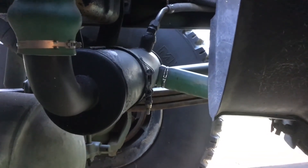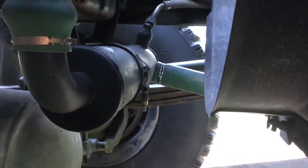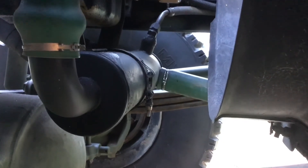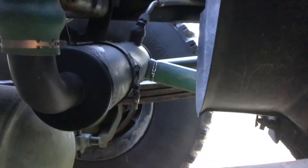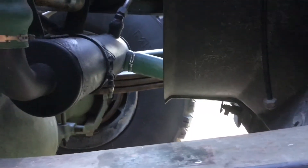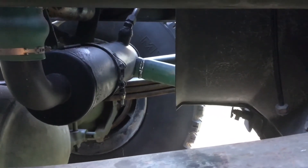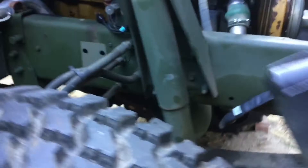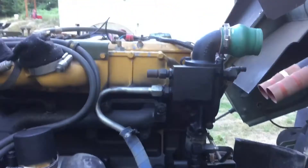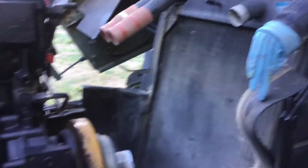So I can still put flow through the heat exchanger if it's really cold outside. I'll probably have the heater on, so there'll be heater return flowing through it — a fair amount of flow through the heat exchanger to pull any heat the transmission generates up into the engine, adding to the overall heat, opening up the thermostat, and disposing of that heat through the radiator.